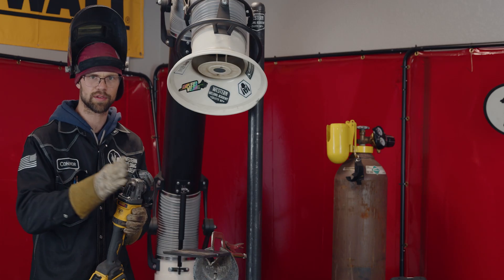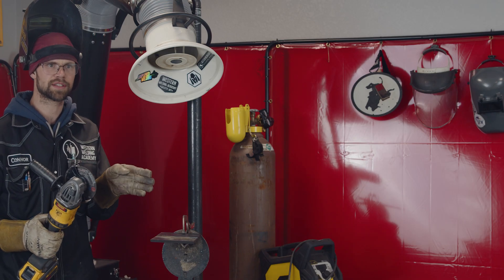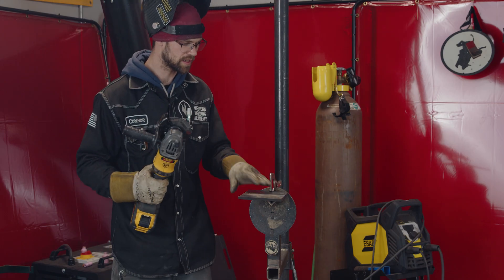It's really important that we stay right in the center of the weld. It's easy to get off to one side of the root or the other — if we do that, we'll end up laying a root in right next to our root instead of through it, and that'll give us two roots side by side. All right, we got our cutting wheel on now, we're going to grind this guy out.